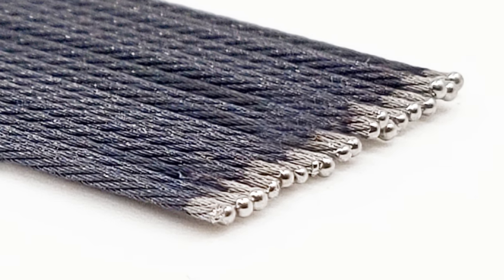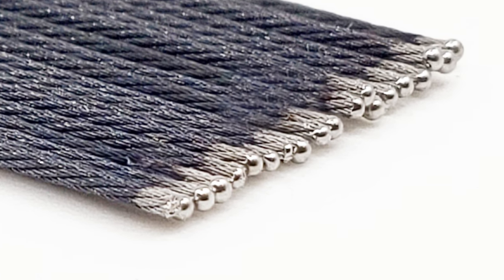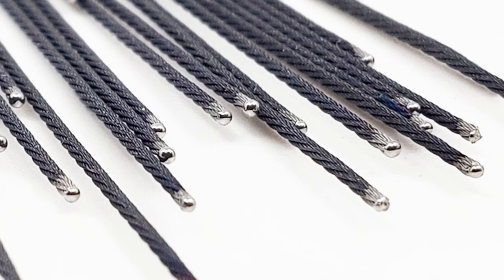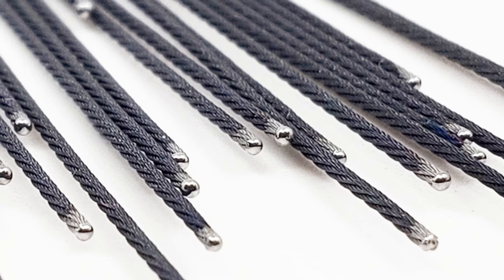Tungsten specifically on the ends wants to fray almost like a bouquet of flowers. Where stainless steel might want to hold its shape. Exactly. So when tungsten frays out, we have to solve that issue as well alongside the bird caging effect. To do that, we do an operation called plasma welding, where it's heated to an incredible temperature and a bead forms on the end to fuse all the cable strands together without having to put a fitting on the end.